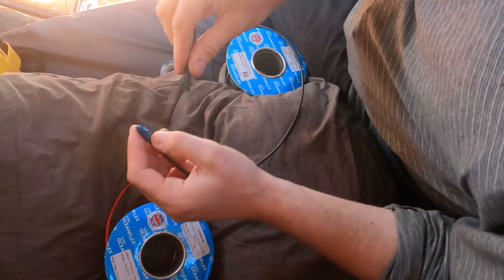Some of the other things I've been doing are getting ready to run the electrical cables forward in the heads. I'm planning to run a main line from the low-power switchboard up to a fuse box in the heads - not a switching panel, a fuse box - so the lighting in the heads will have its own independent set of fuses. That way it won't be complex to extend. What I did last time was safe, but I don't want to keep teeing into cables repeatedly. I'd much rather have a set of higher-capacity low-voltage lines going forward, then fuses, and then a series of lower-capacity lines going out to the individual lighting services.